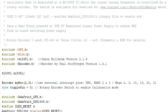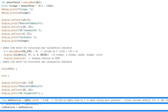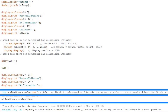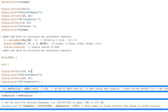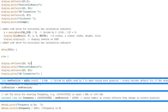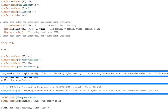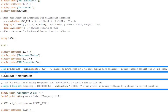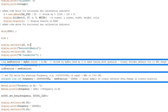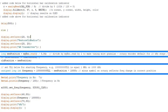You can find the sketch, bill of materials, and schematic in the video description — I'll place the link there. Looking at this line of code: to change the bandwidth, I take the long new position equals encoder read and divide by 0.04. You can change that to 2 to get down to just a few kilohertz steps. You'll also see the starting frequency just below that — set the ULL value. I've got mine defaulted to 1 megahertz, which is 1,000 kilohertz, and you can adjust that number accordingly.